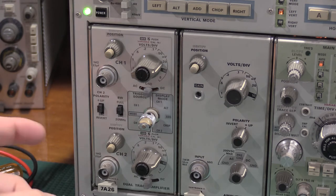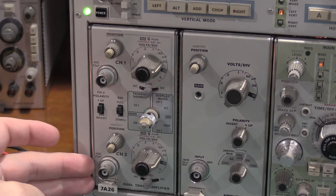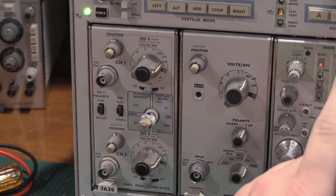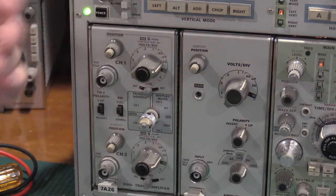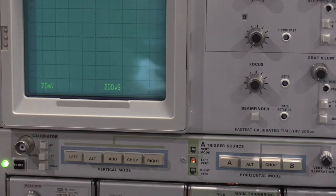All right, well, I pop this plug-in, my test plug-in, got readout. Pop the plug-in that was under test, got readout. So that means most likely the problem with the plug-in is a dirty edge connector. So I'll be cleaning that for sure. Yep, readout's working. Let's see, where's my 100x probe? Here it is. 2 volts. So readout's working.